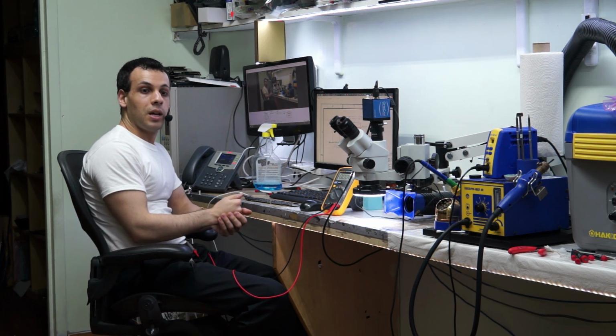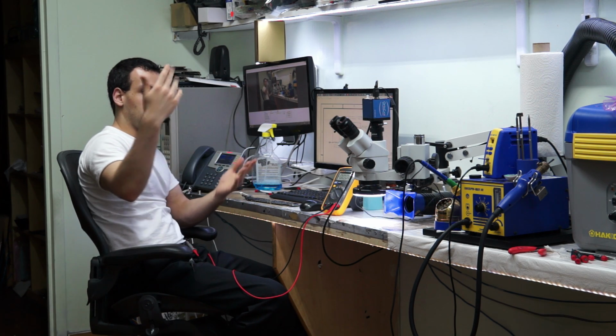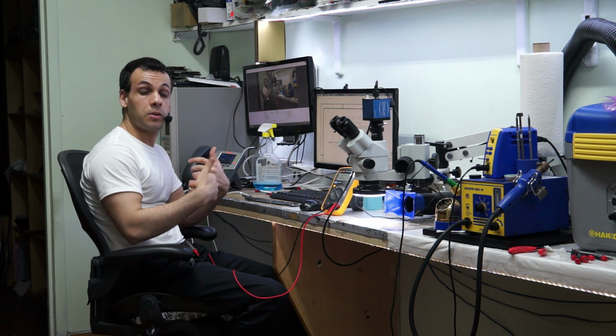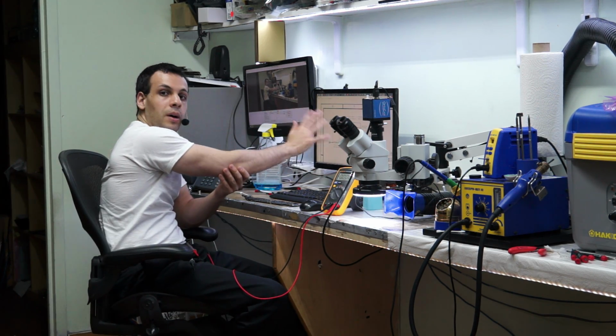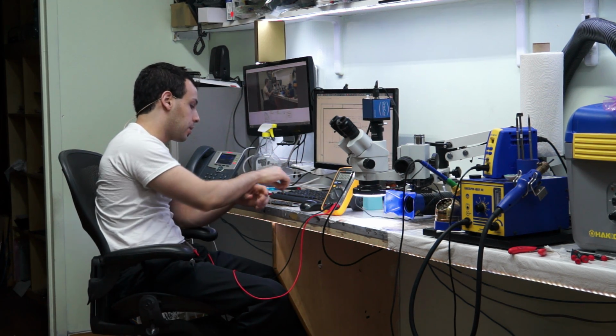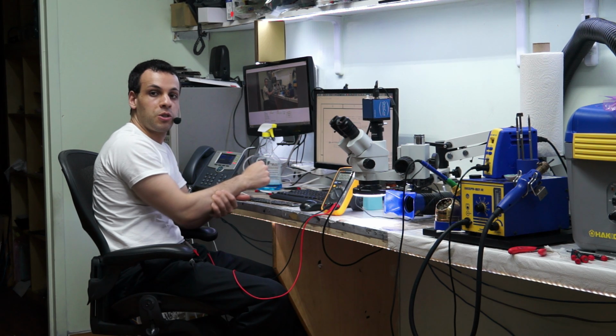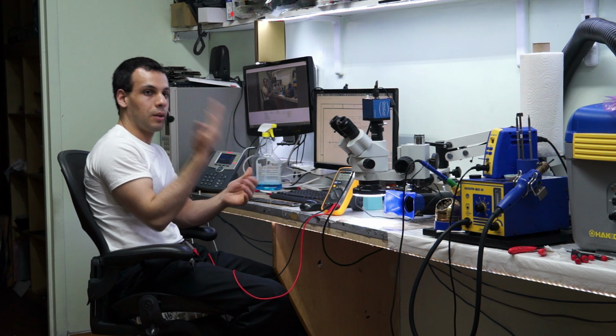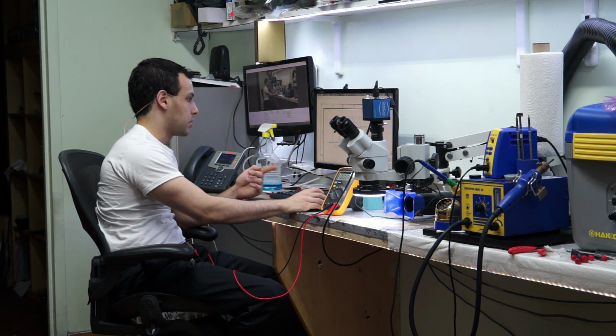It's going to tell the PCH to do things like read these signals and then do this and do that and turn on and all sorts of stuff that, again, if you're a computer engineer, you're going to understand a lot better than I am. But the BIOS chip is required for the PCH to send any of those signals. If you take a perfectly working board and you just take away power to the BIOS chip, you won't get any of those signals out of the PCH. You won't get PM sleep S4L. You won't get PM sleep S3L and any of those.